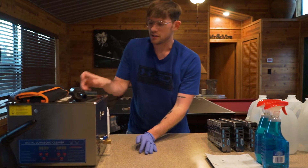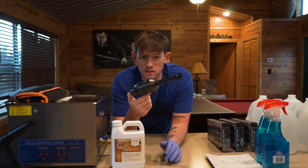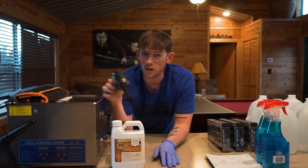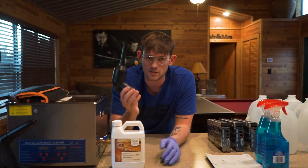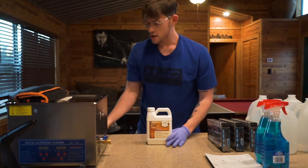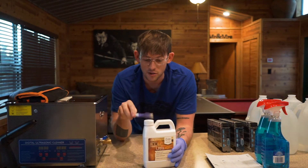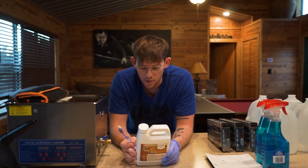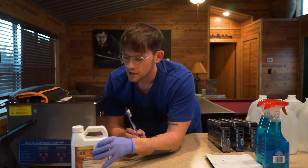The second way we're going to clean a graphics card is with a tiny little vacuum and isopropyl alcohol. We'll take the cards apart, use the vacuum and go over the PCB to get all the particulates up, because if you put liquids on a bunch of dust it makes the cards really gross. Then you come back with a toothbrush and isopropyl alcohol, scrub it really well, and your graphics cards will look brand new. You get problems when you have a lot of dust or moisture buildup under your memory modules.